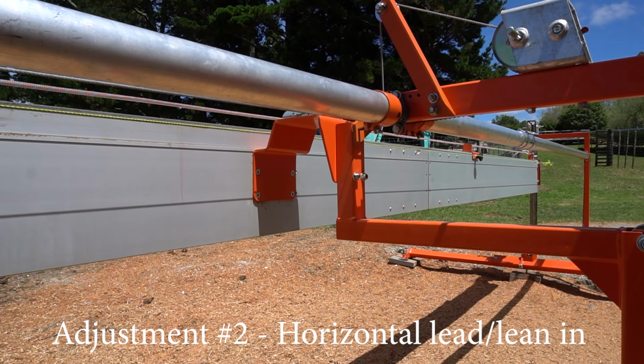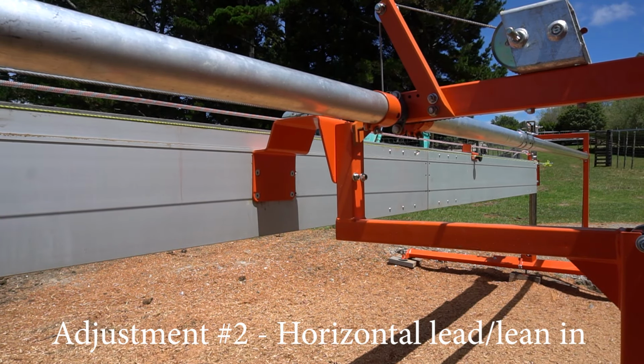This machine has a center leg. So before you do that roller adjustment, you'll need to loosen off these four bolts here so that it can relax the beam. And then you can put shims in there to accommodate whatever you need to rotate the beam at the particular angle. So now we're on to number three, right?